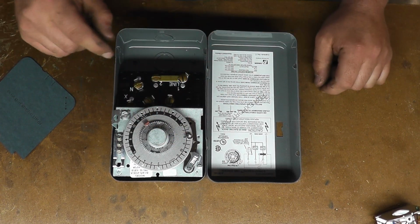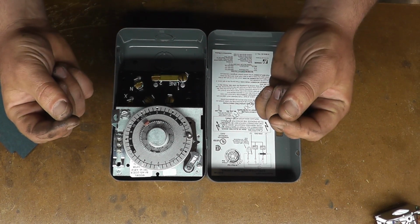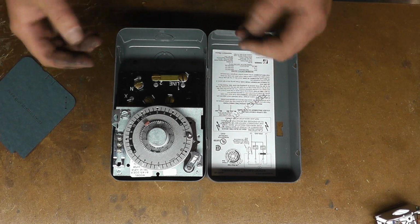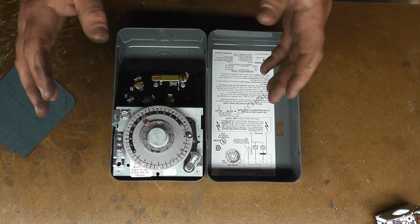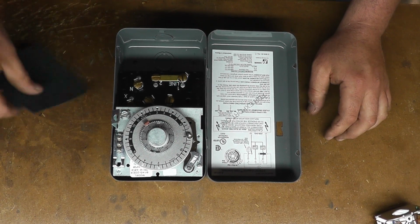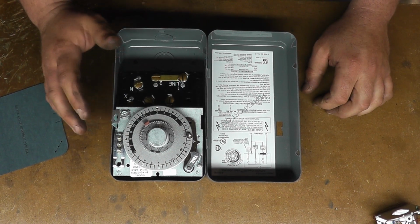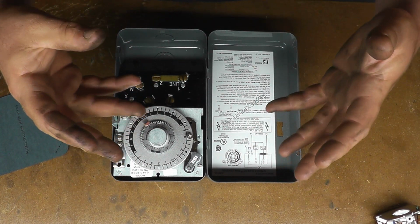These are all adjustable. What happens is your refrigeration shuts off, heaters turn on in your evaporator coil, and that melts the ice off, because the freezer is so cold. The air temp in a freezer, by health department standards, has to be 0 degrees or below. We like to keep ours at anywhere between -5 to -10, sometimes -15, depending on some applications. Some of them, we have deep freezers that need to be down to 20 below in some places. But anyway, that coil is so cold that any moisture in the air will instantly freeze to that coil.